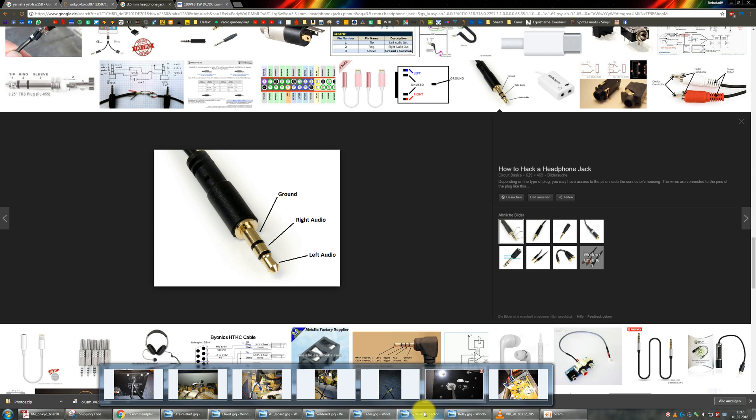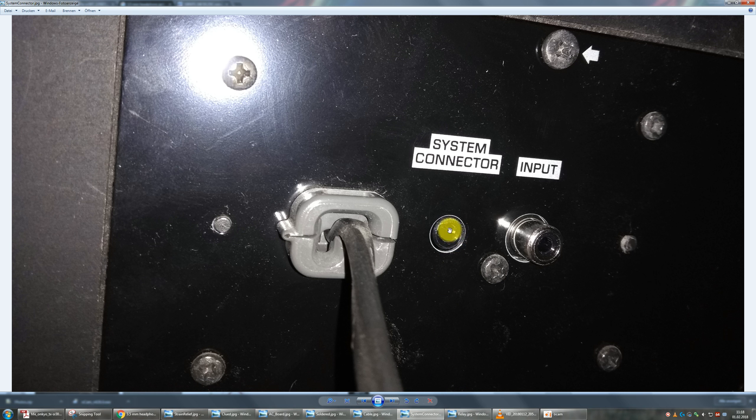What you need to think about is that the system connector ground is the same as the signal ground — it's the same as the outer ring of the coaxial input. So you really need to think about this so that you don't create a ground loop between two different power supplies. What I did was use a galvanically isolated DC-to-DC converter to power the system connector, to get rid of any hum that could be caused by ground loops. Otherwise, when you use another ground coming from your amplifier, you effectively create a parallel ground path or a ground loop, and you can induce a lot of hum into your system — especially at low frequencies since we're dealing with subwoofers.